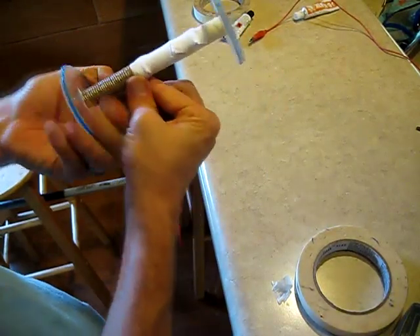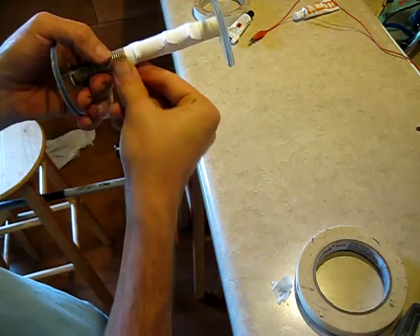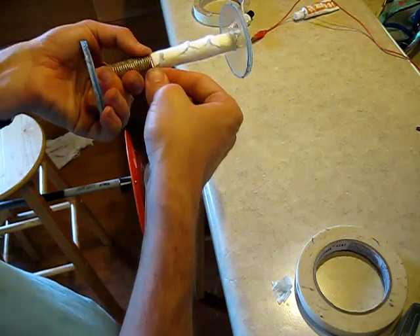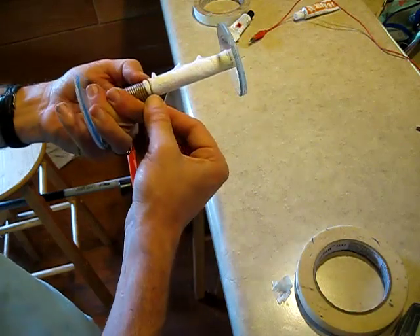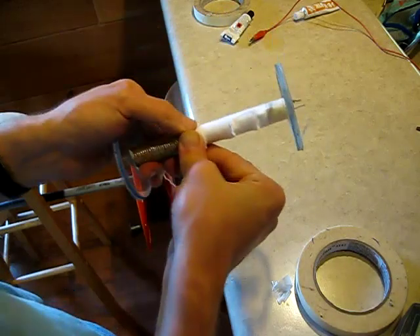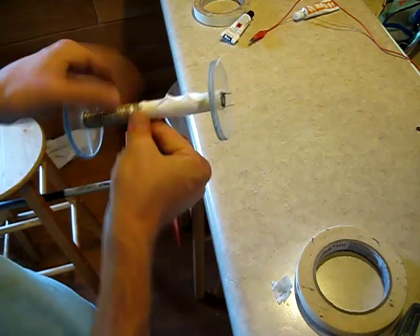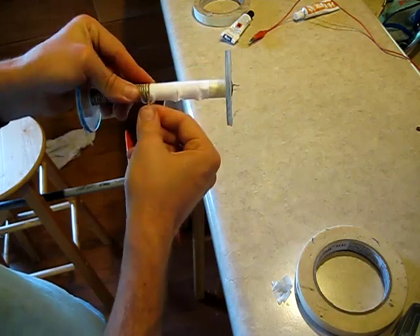We're coming up on the splice here. The splice is running right under there. I'm going to come up close to it on one side — you can see that cotton covered copper wire is going right by the splice on this side. Now as I come to this side, instead of trying to go up and over it, I'm going to put a bend around it on this side, and then return back next to these wires. I'm just going to try to even out that bend over the next few winds by leaving a small amount of space on the back side. I know this is going to mess it up a little bit, but that's the way I do it — I'm sure there's better ways.